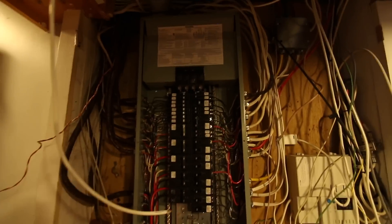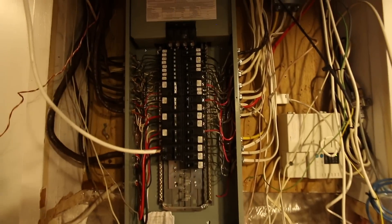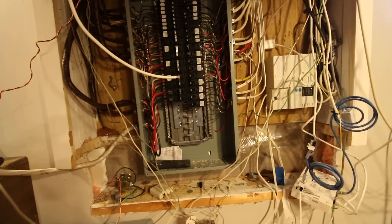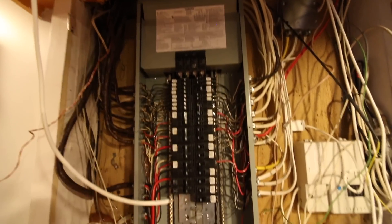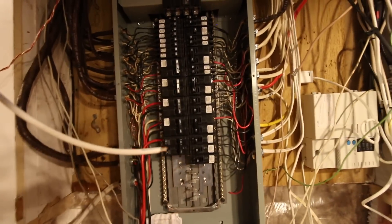Only a fish keeper would say that. On the topic of generators though, wait till you see the electrical outside — it's looking really good and we've made a lot of progress. The 200-amp panel has been installed. It's still quite a mess in terms of needing to be cleaned up, but it is installed. I'm going to have to build new doors to fit this area because this panel was actually twice as big as the 100-amp. Everything electrical will be completed today.